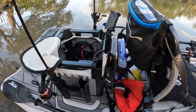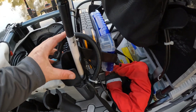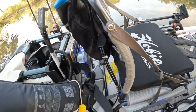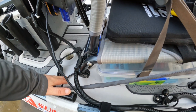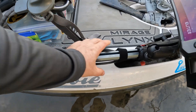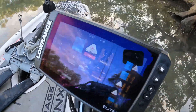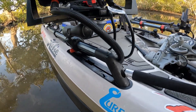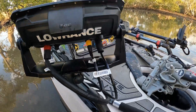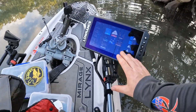On the other side of the kayak, inside the box you can see the power cable for my FS9 unit, my ethernet cable, and my three-in-one transducer cable. They all route up the rail — I've got some velcro there — up to another clamp and RAM bracket, and then to the display itself. I've blanked off what I'm not using. It's pretty sturdy on there and I haven't had any issues at all.